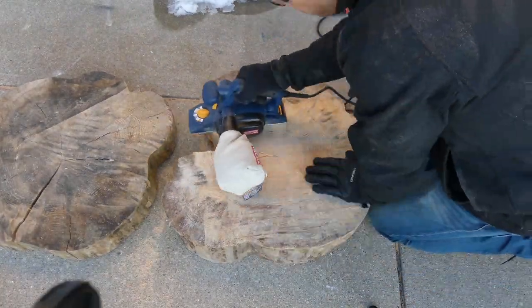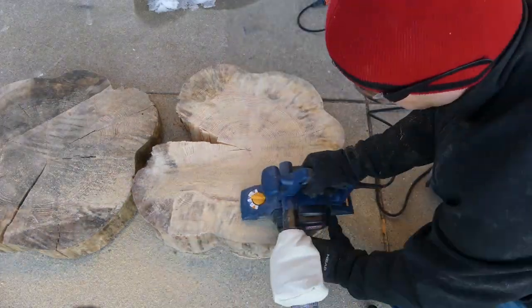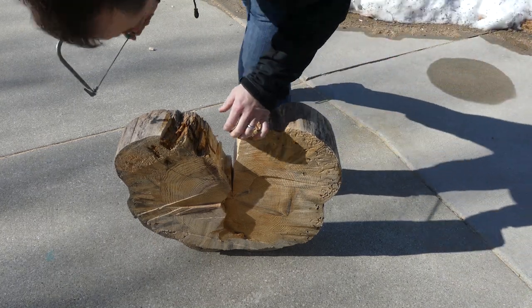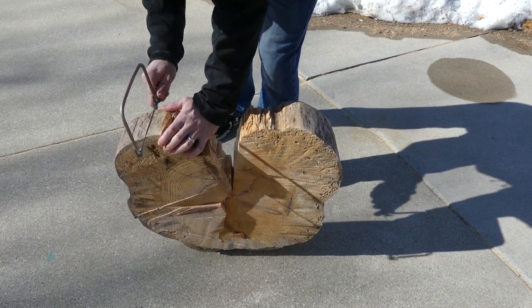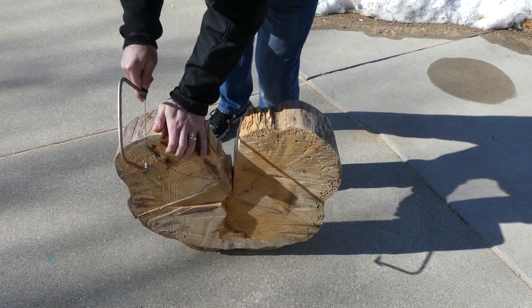And here's really where I made my first mistake, shaping before flattening. I got impatient and wanted to trim the wood down to the coffee table shape before I got to the right thickness. I tried the coping saw, but, well, that didn't work so well. If I'd flattened the wood first, I could have used my bandsaw or jigsaw. That's lesson number one learned.